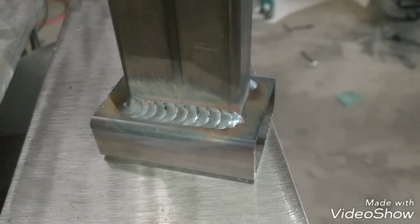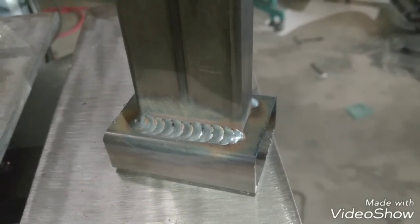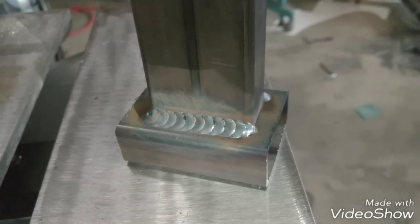When I move forward, I'm pushing forward into that groove and I'm just staying in that, and then I'm coming up and wrapping around, staying on the leading edge of that puddle. I'm not pushing out of it — I'm staying in it and coming up and just wrapping down. Once you're happy with how your weld turned out on the material thickness, just write them both down — what setting you used — and store that away and keep moving on with your other materials.